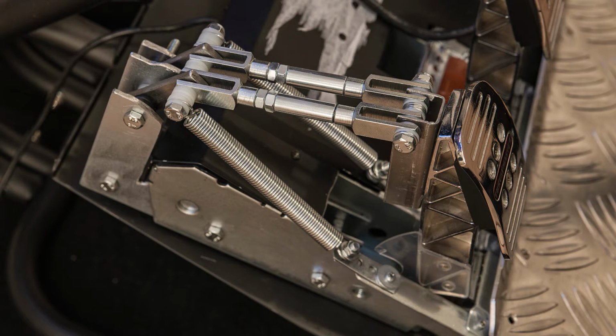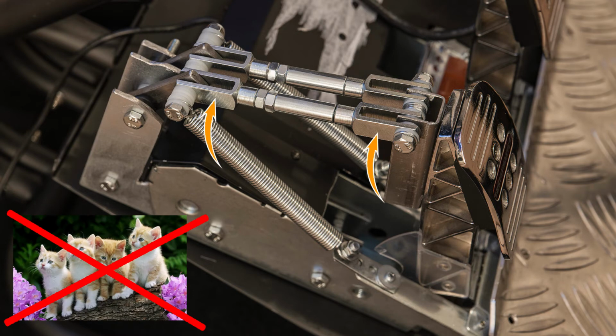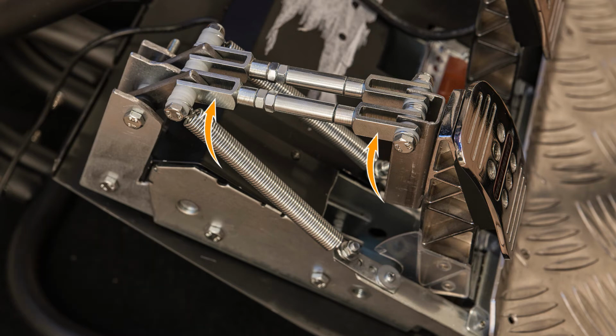Coming now to the long arm, which connects the first axis to the second axis. The arm consists of 2 fork heads on either side and a 6 centimeter threaded rod in between. The rod is actually covered in my case with a connecting nut and 2 regular nuts. I'm actually using 2 of these arms to avoid flex, and all of the parts are M6.